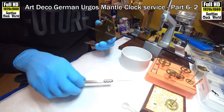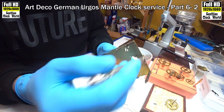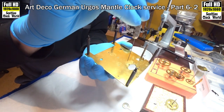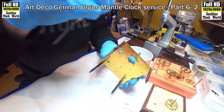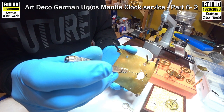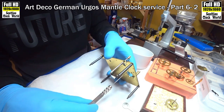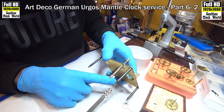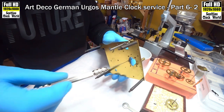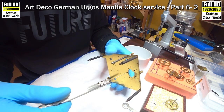Now, to use a cutting broach, you have to align the broach at 90 degrees to each of these faces, so it has to be perpendicular when you see it like that. If you put it off to one side, you're going to cut a hole at an angle and the wheel is going to flop around inside it and it won't run smoothly. So before you start, line up the cutting broach there. You can use the posts as references if you like,